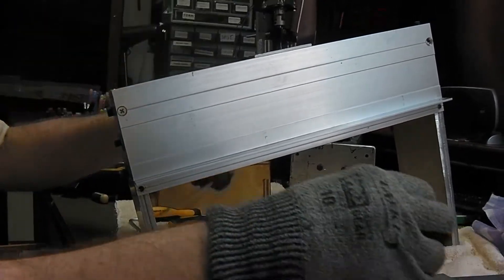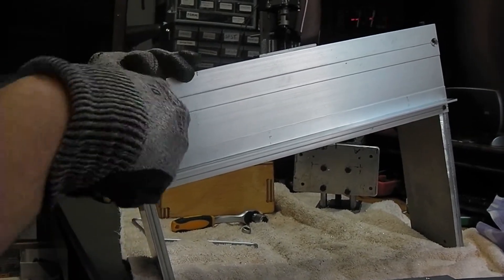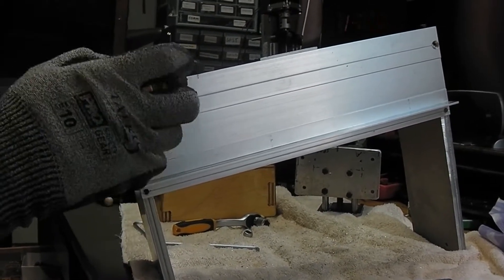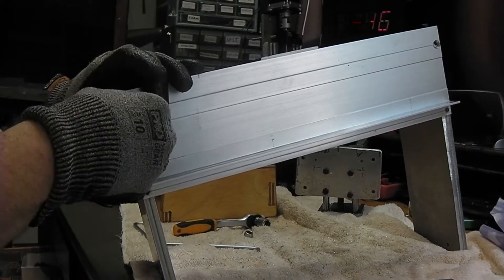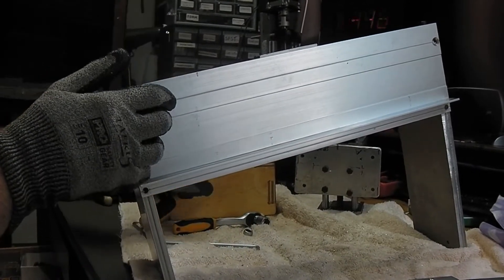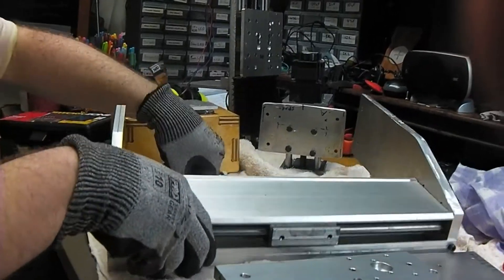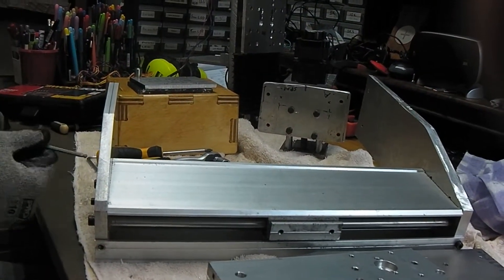This would have been assembled 40 years ago. The bolts weren't too bad, but the ones actually holding the Z-axis on were quite loose. Anyone with these machines — I'd recommend fixing that as preventive maintenance. Better than having it fly off at you or losing the Z-axis mid-cut, which really wouldn't do much for you.